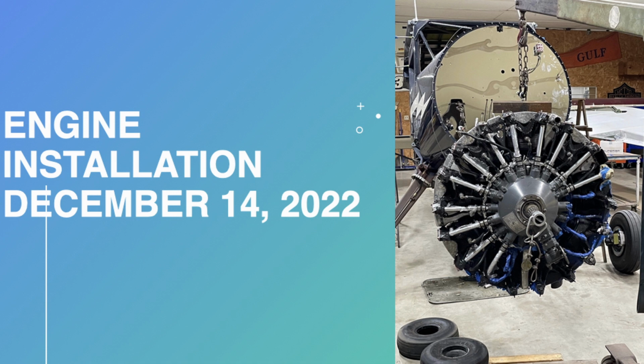So was the engine damaged in the hurricane? So that was the $1,000,000 question right there. The best I could tell was never hurt, never turned. When I got the engine off, I went ahead and had the magnetos overhauled, put on the Jasco alternator, had the carburetor overhauled, had the prop overhauled, did a few other things to it like the distributor caps and the rotors, had all that overhauled by Radial Engines. And so I did pretty much everything to the engine that could be done short of taking it down.